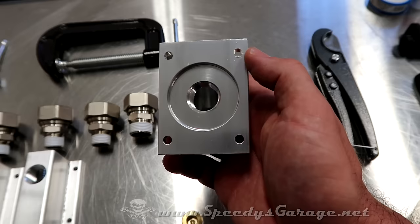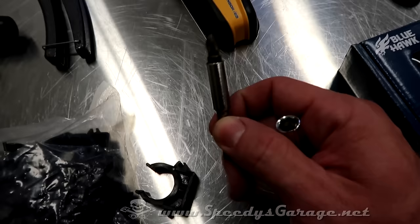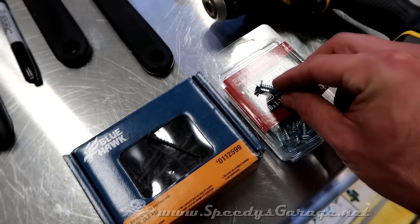But either way, they're just a little bit too wide. So what I'm gonna do is line it up so that at least 2 of these go into a stud, and then I'll use sheetrock anchors on the other 2. Requires some tedious measuring, but it's only 3 of them, so it won't take too long. And then you're gonna need your adapter and your Phillips head screwdriver bit for your drill, as well as a 5/16 socket adapter. That's for the sheetrock screws for the clips, and the number 10 self-drilling screws for the blocks.